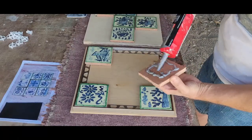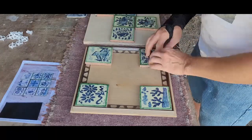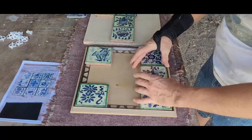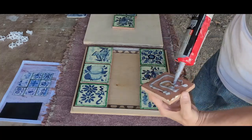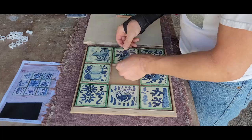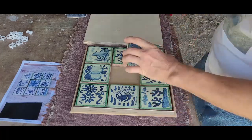in place. I made sure to match the layout my friend had asked for, starting in the corners first. These tiles have no straight edges, so I have to work by eye. Once the corners are set, I can eyeball the 4 outer tiles, keeping the spacing as even as possible. Finally, I added the center tile, again working to keep things as even as I could.